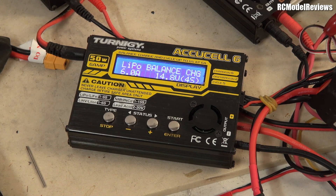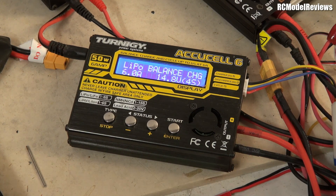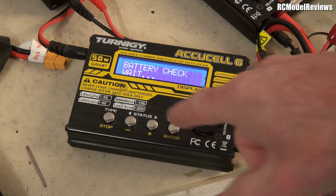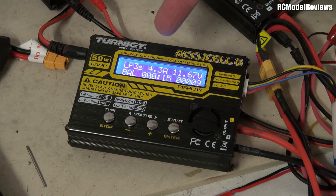So that's the thing we've got to watch — it is the amount of power or the amount of current. I don't have a 2S, but I do have a 3S. Let's see what happens if I change it to 3S. The voltage is down to 11.35 volts — I'd expect we'd get 4 or 5 amps. Ramping up — 1.3, 2.8, 4.2, 4.3 amps. Still limited: 12 times 4.2 is 48 watts. We're getting 48 watts of power — hitting the limiter again.